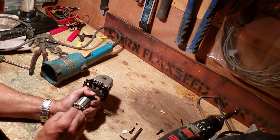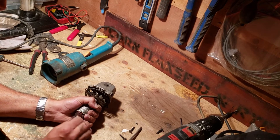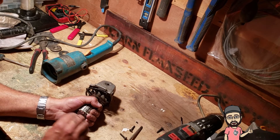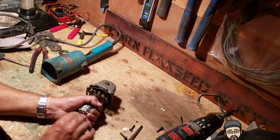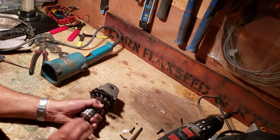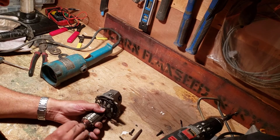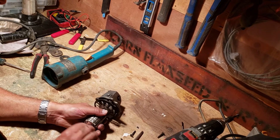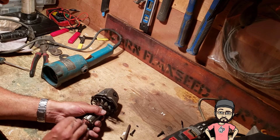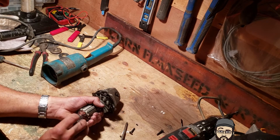This is the old brush for reference. Very little pressure — just clean it up and make it smooth again so the new brush won't wear out too quickly. I'm going in the same direction that the commutator turns so that it won't create any marks that would wear out those brushes too fast. It's turning a nice shiny copper color — I think it's cleaned up. Actually it's not nearly as damaged as I thought — it's just dirty. All that carbon from the brush stuck on there.